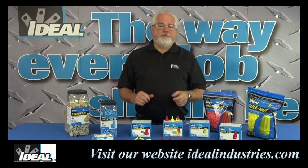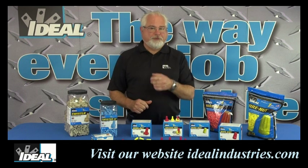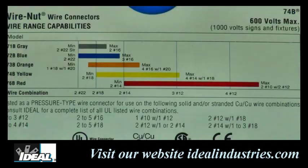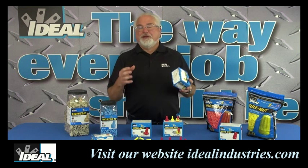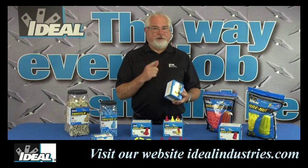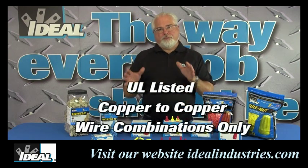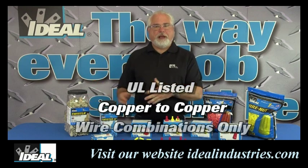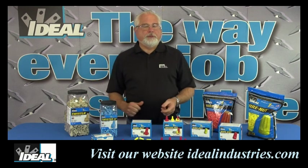In this video I'd like to give you some tips for using wire connectors when making up electrical connections. The first tip is to refer to the packaging the connector came in — it will tell you what wire combinations that connector is listed for, so make sure the conductors you're using will actually fit inside the connector. You'll also find the recommended strip length on your conductors there. Keep in mind that all these connectors are designed for copper-to-copper wire combinations; they're not UL listed for copper-to-aluminum or aluminum-to-aluminum connections.